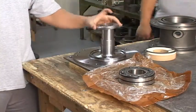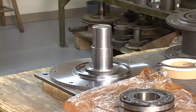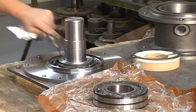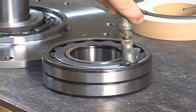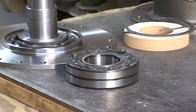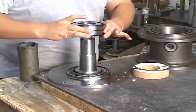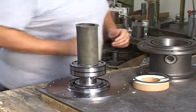The first thing we're going to do is put on the thrust collar. Then we're going to take the bearing, which has been pre-greased, and put some grease in the bottom of the spindle. We've already greased the bottom of the upper spindle and put the thrust collar in place. Now this bearing has to be pressed on. If you're rebuilding the sifter and the bearing comes off real easy, you need to have a new upper spindle. This bearing has to be a press fit, otherwise it'll spin on the spindle. It should be put on with a 10 or 12 ton press.